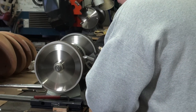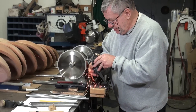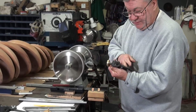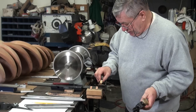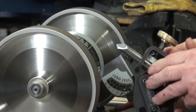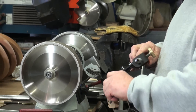I'm going to stand here and look right at that end. I'll switch hands and look right at that end so I can see where I'm grinding. That matched up real close. Now I want to take the heel off — I'll stick this little block of wood in there, which is about 5/8 of an inch, and do the same thing: just make one pass on either side to take the heel off.